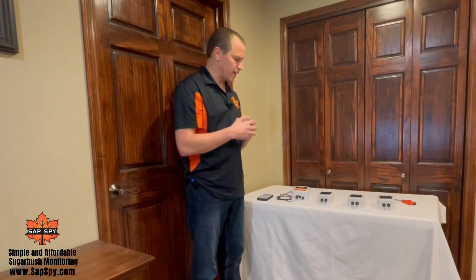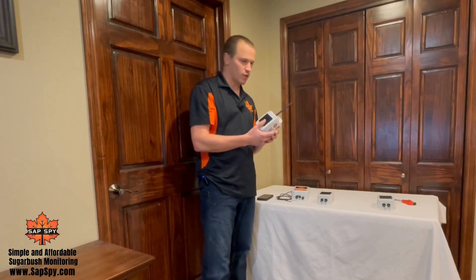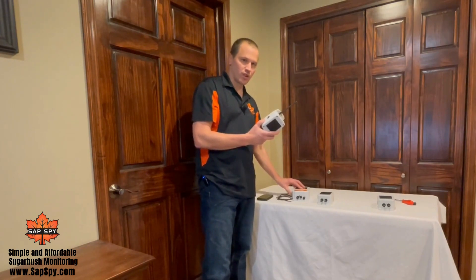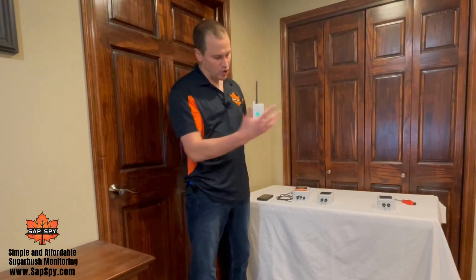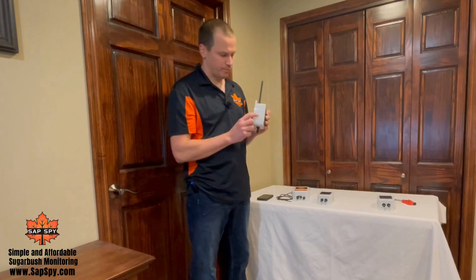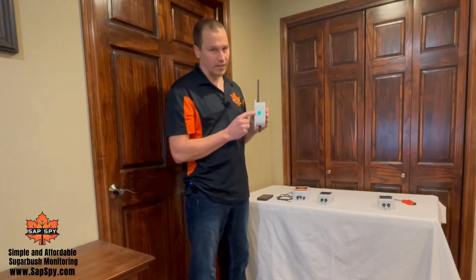The second scenario is if the node is out of range of the hub and nothing is configured as a repeater yet. It's hard to simulate here — it's a little cold in Wisconsin to do this test outside — so to show you what this looks like I'm going to turn the sensor hub off. Once I turn the node on, it sends a join request but there's no device anywhere around, so it's going to show a solid green that doesn't go away, then blink four times. If you see a solid green that doesn't go away, the node is likely outside of range.